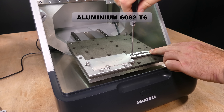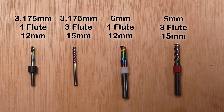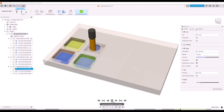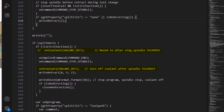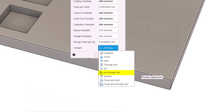First we're going to mill some test pockets in aluminium. I've created a project in Fusion using four different tools. There are three toolpaths for each pocket: an adaptive roughing operation, a horizontal floor finishing operation and a contour wall finishing operation. The Z1 post processor is not yet available so I've used the Carvera post processor and made a few modifications — setting the AeroDust to be turned on and off with a coolant type of air through tool by adding M811, S100 and M812 G-code commands, changing the coolant to be turned off after the spindle rather than before, and adding a time delay so that the spindle can stabilise its speed before commencing operations.